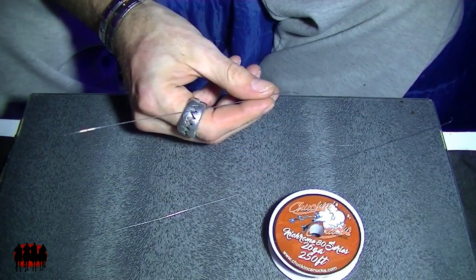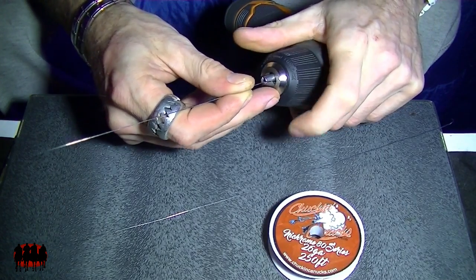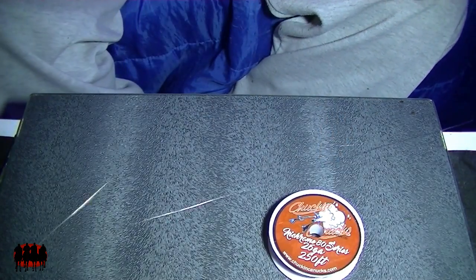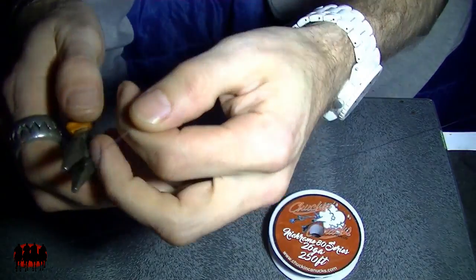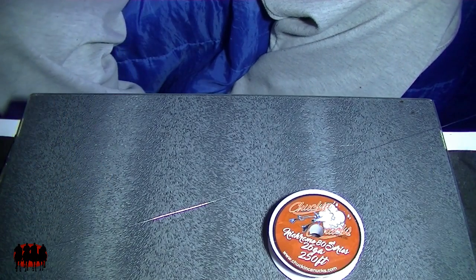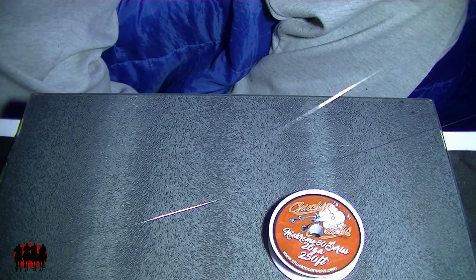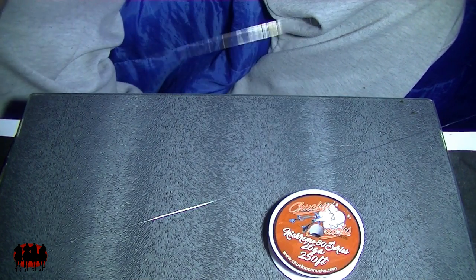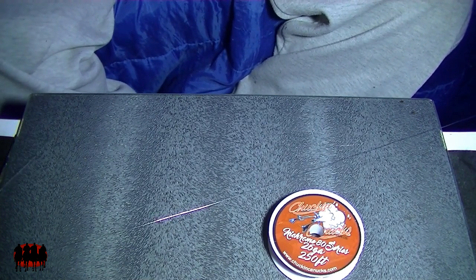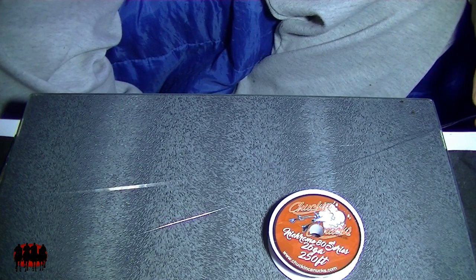For you guys out there that don't know that yet, you put your wire in the chuck of your drill, you take your pliers by the other extremity, and you twist with the drill, and there you go, your core, it's nice and straight. Alright, so you're gonna go ahead and do that with the 1.5 meters long, so you got one big straight wire.